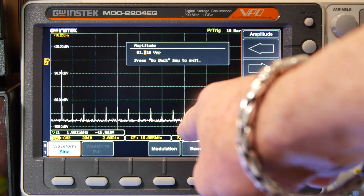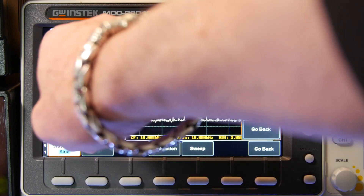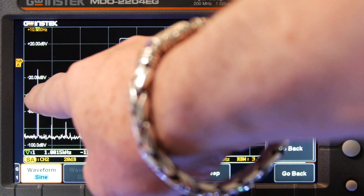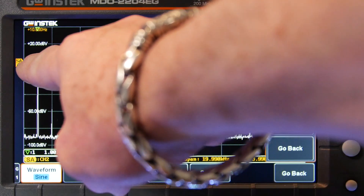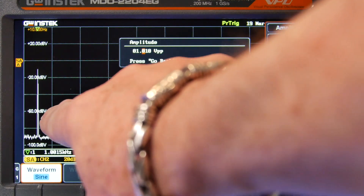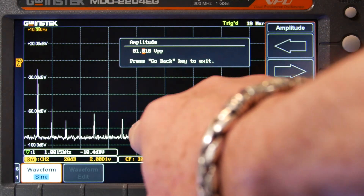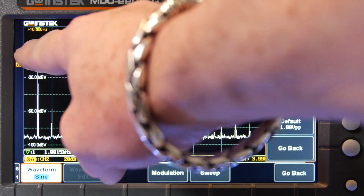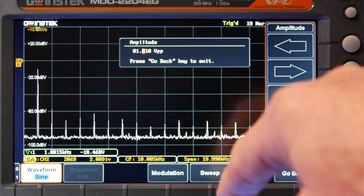What we're looking at is the spectrum of our generator coming from the scope going into the input of our amplifier. This green marker is at minus 12 dB, equal to one volt peak-to-peak. You can see the first harmonic is right there at minus 60 dB. One volt RMS would be here — this is 100 millivolts, 10 millivolts, one millivolt — so the harmonic is right down around one millivolt, and the others are even less. When we look at the output side of the amplifier, it's going to amplify all of this — if the fundamental goes up a frame, all these harmonics go up a frame too.